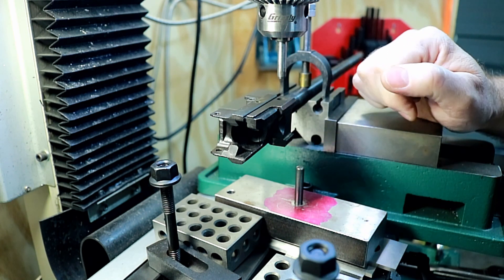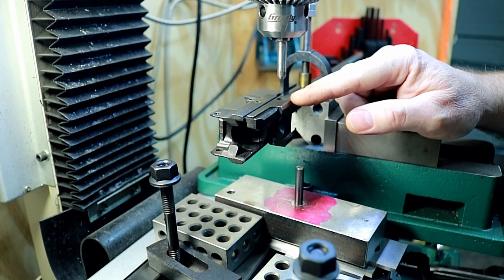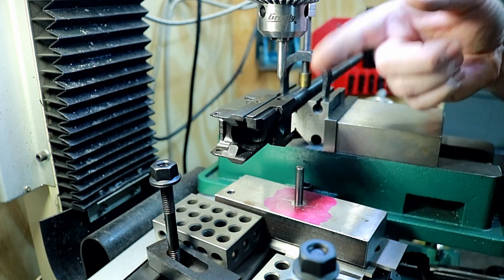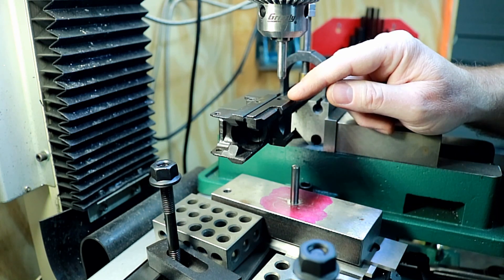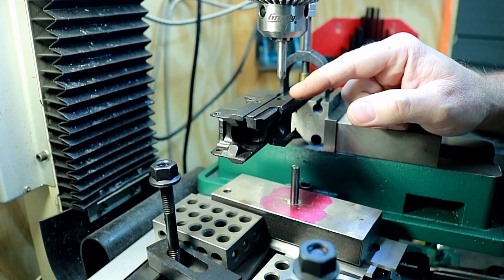The hole is perfect — I can use the same size barrel pin hole. I've had guns before that had an already oversized pin in them and I needed to re-barrel. It had like a 5/16ths barrel pin in it already. Well, you don't really want to go any bigger. So I need to use that size pin without trashing the trunnion or fixing the hole in the trunnion — how am I going to chase that? This works perfect for that, although these pins here would not work; I'd have to make an oversized one.